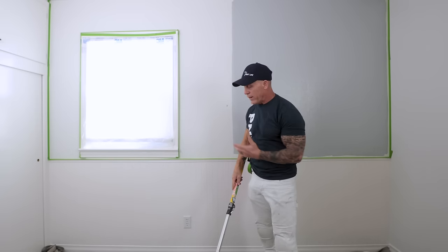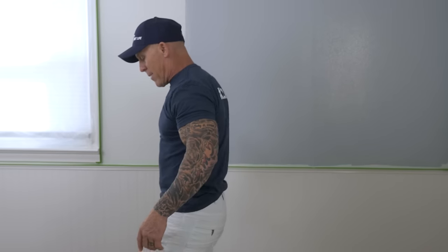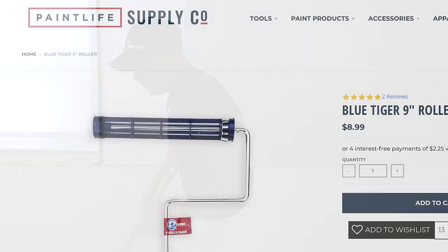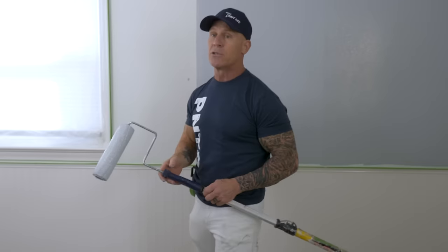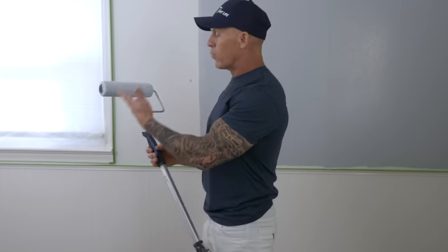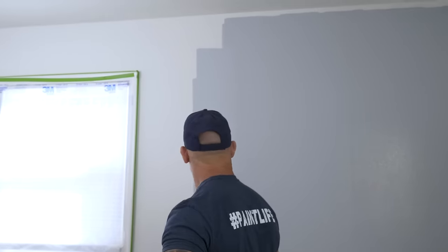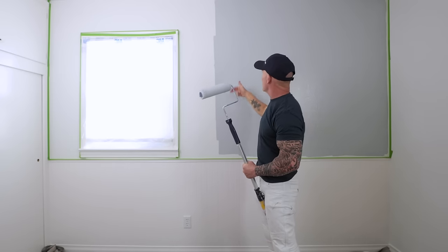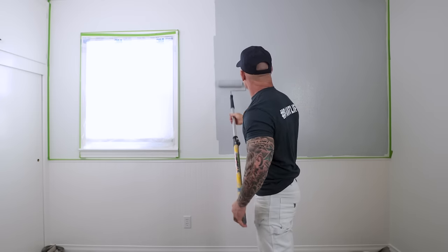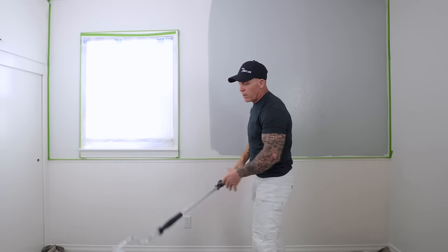That's how I like to roll a wall. I'm using this method priming for an accent wall, but if I was doing floor to ceiling it would be the same method. I'm using just a nine-inch roller — a lot of people will ask why not an 18-inch, but for a small wall I don't need one. It takes more paint to load and more time to clean up. I set it in the middle and begin unloading until paint is evenly distributed top to bottom — you want the same mil thickness at the bottom as at the top.